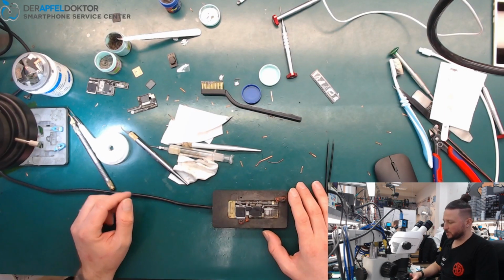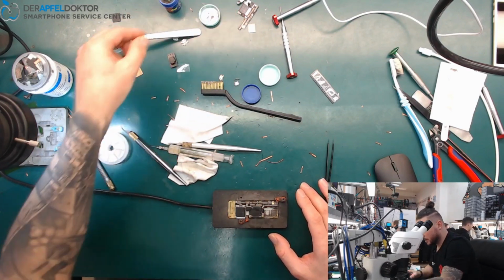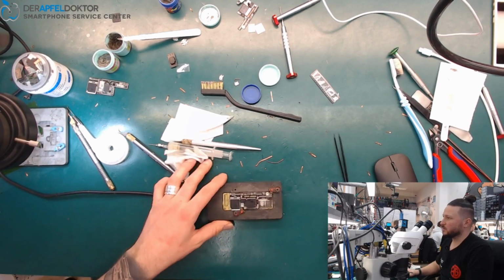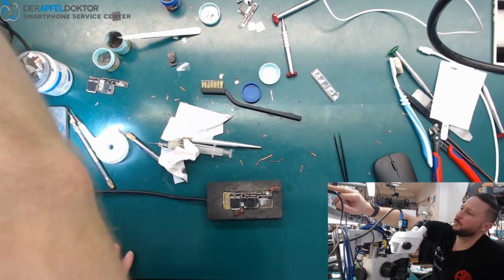That was a really fast entry in the video, I think. What I already have prepared is the old board, NAND, CPU, but they need a reball, okay? We need to copy the logic ROM data, and we need to prepare a board for doing the swap.